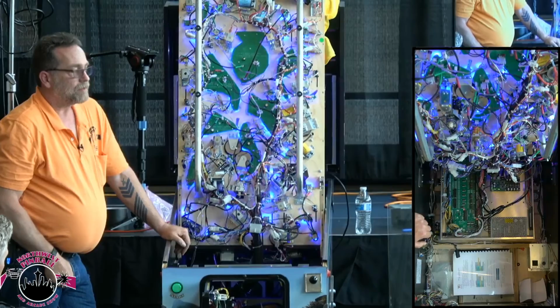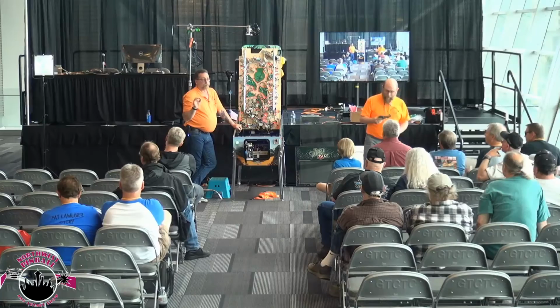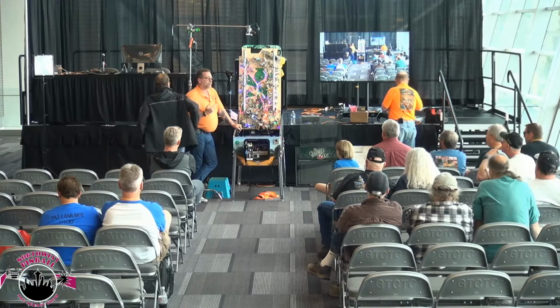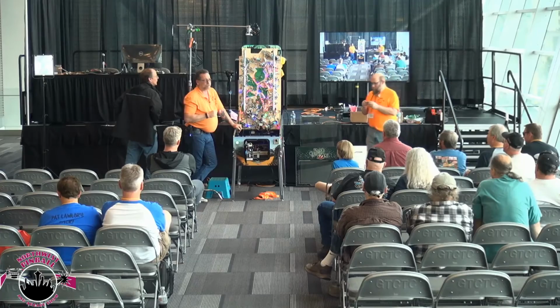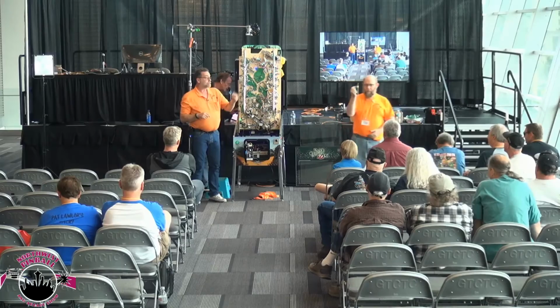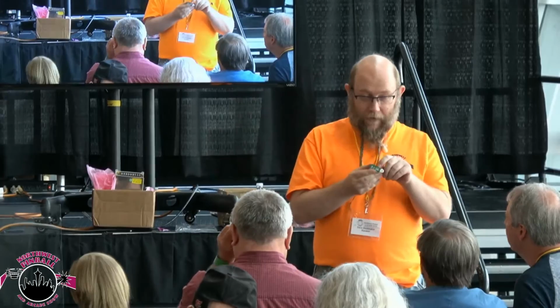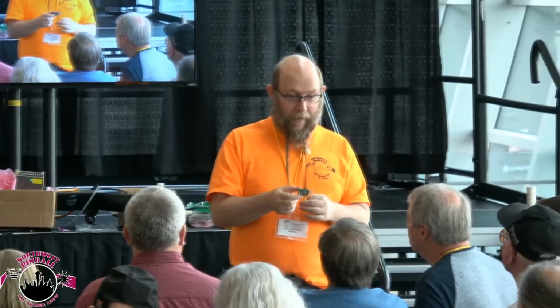See, that is an old 5-volt board fuse. On the 5-volt boards, most people with good soldering skills can change that fuse. With the 7.5, they're surface mount, and basically it takes a little mini hair dryer to solder them in place, and a 100x camera to make sure that you're okay. Seriously, this board has a fuse. It's right there. So being able to see it, recognizing it, and then replacing it without the right equipment is very problematic. So yeah, that F100 is the fuse.